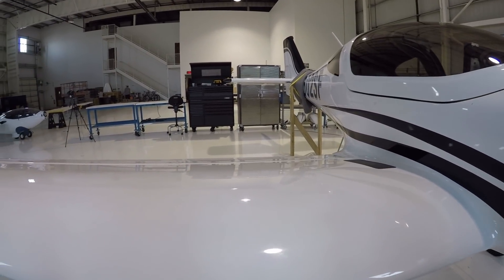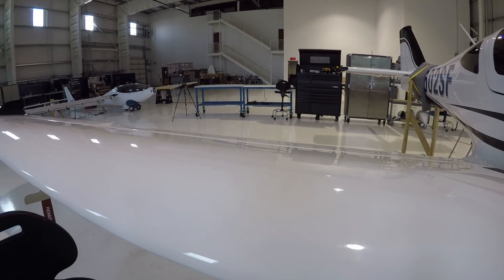Watt hour is a measure of energy per unit weight in kilograms. Over the last five or six years of flight tests, we've gone from 100 to 160 to 200 and now 260 watt hours per kilogram — a nice progression in improvement of lithium ion batteries. We expect that to continue to improve, but we've fixed on this battery pack design together with the FAA so that our market entry and certification in about two years will use this chemistry in this very safe battery pack design.